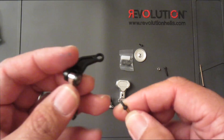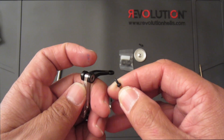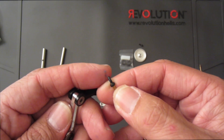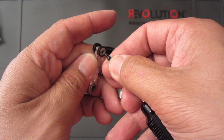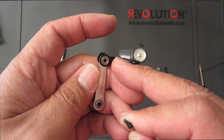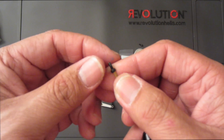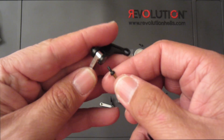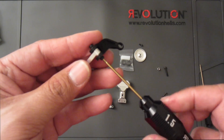I just put a small drop on it and make sure it's spread on the threads. What's important — and most people make a mistake on this — is they put a big glob of Loctite on the screws and when they insert it, it bleeds out and gets onto the radial bearings, which will destroy the bearings over time. Just put a very light coating or one tiny drop, spread it with your fingers, wipe with a rag, and then you have a thin coat when you insert the screw.